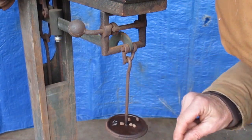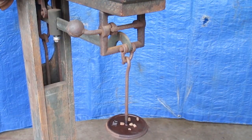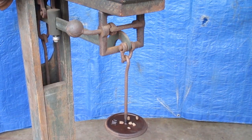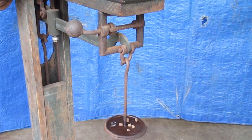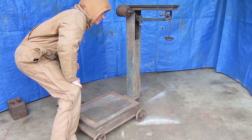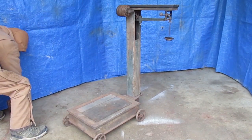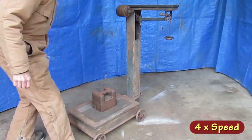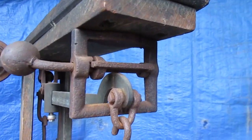That bullet was too much. Luckily there's a half-bullet fragment here, so I'll put that many bullets back in the bottom of the weight hanger and the zeroing weight will be within the proper travel range again. That zeroes out nicely. Let's see what happens with the 50-pound weight.